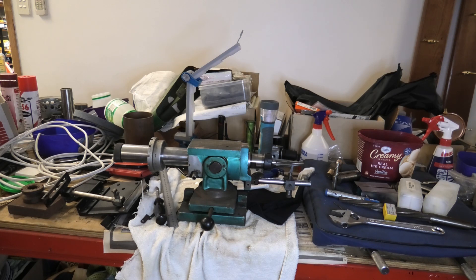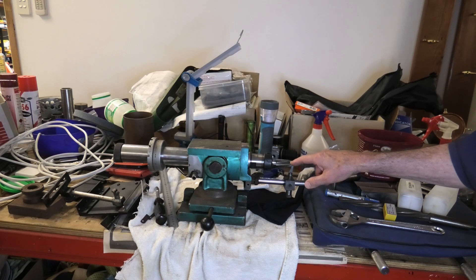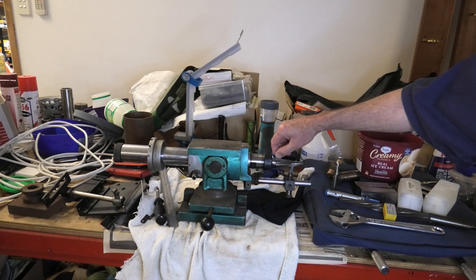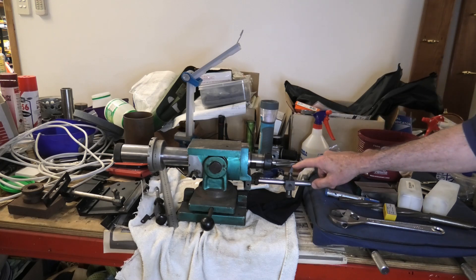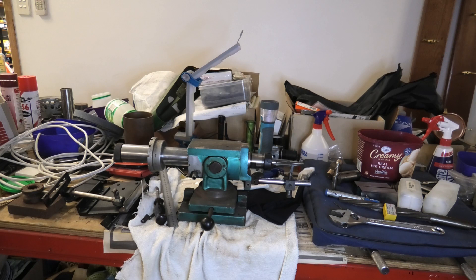So I'm going to get that away. I made a nice little rounded finger for it - I thought it would have gone well. But when you get towards the front where the flute diminishes, it starts to ride a bit rough. And back here the outside of the flute is ground, but right in the gullet it looks like it's only rough machined, and that's grabbing on the top of the indexer and making it jerk. So I don't know what I'll do - I think I'll try my good old big fat indexer. We'll see what we can do. I'll think a little bit more, then I've got to get home - I've got housework to do. But that's it for now.